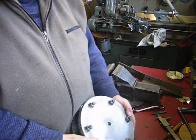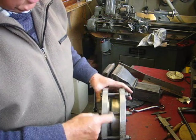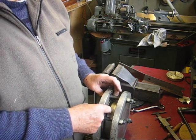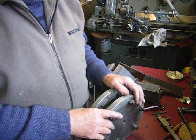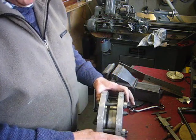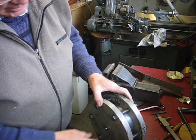There it is — all tightened up. You can see the rubber is spewing out the side here. So it's really pressed hard now, because it's pressed the metal right into the groove of the die, I hope. I'm going to take it out into the garden now and give it a hard blow with a hammer, and then I'll let you see the results. Now I'm loosening off the bolts a little at a time, all the way around — a gradual process, otherwise the rubber will come in from the sides and distort the diaphragm.